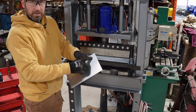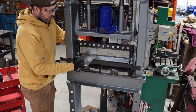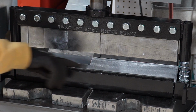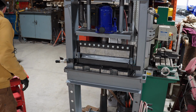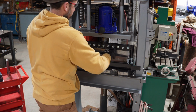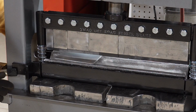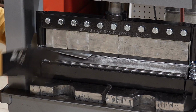So like if I wanted to make that 1.5 inch bend there, that's just over 1 inch. I line that up. Let's go from the back so you can see it. If I line that up on my line, on the finger there, I have nothing to bend against, right? So your bend radius is a huge issue. Now with these other two in here, it will actually work. It's close. It catches right on the edge, but it'll work.